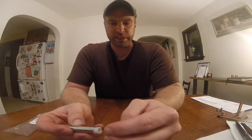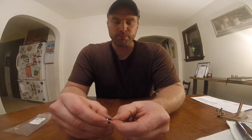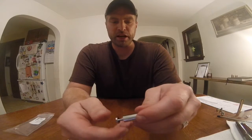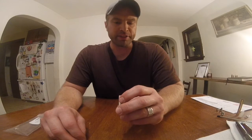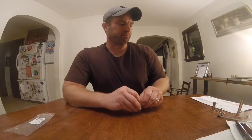When you screw it back in — if you do take it apart, which you shouldn't really need to — you could put a little blue Loctite on there to hold it in nice and tight. You just need to be careful that when you put it back together you get the white insert all the way seated back in, otherwise it won't snap together quite right. So just be careful that it's seated correctly if you ever take this apart.